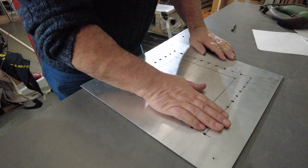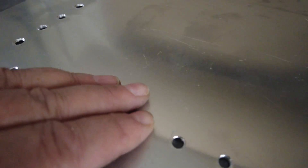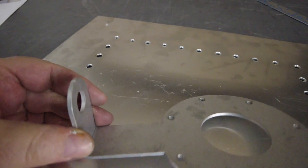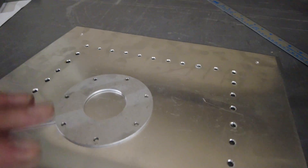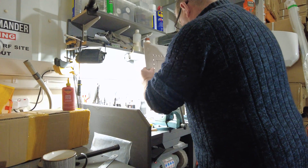I ended up using cutting fluid and all sorts, and I wasn't recording at the time, but anyway, we've cut a hole. I normally use something called 5251, which is a really lovely aluminium — that's what we use for the plates. This material here is a much cheaper aluminium; 5251 is just a lovely general-purpose alloy. If you're ever specifying it, that's the one to go for. I've forgotten to drill the four corners so we can get the jigsaw in, so let's do that.